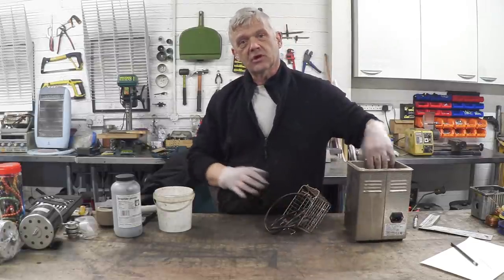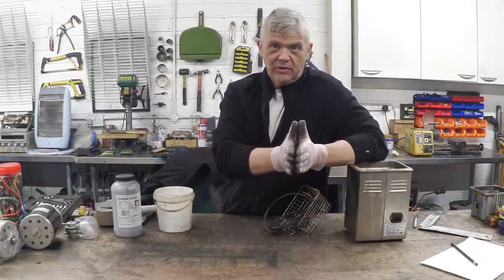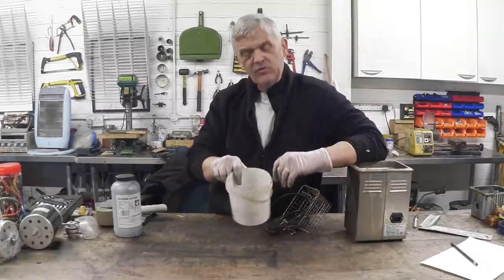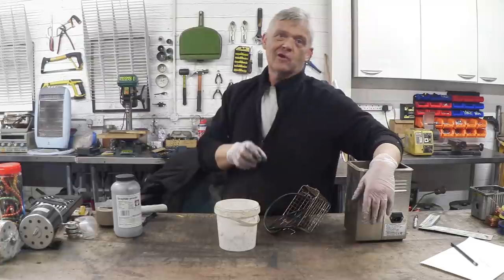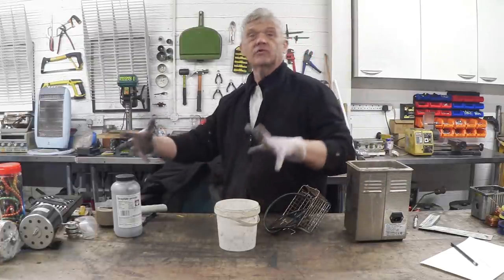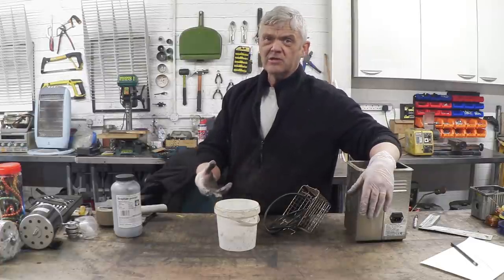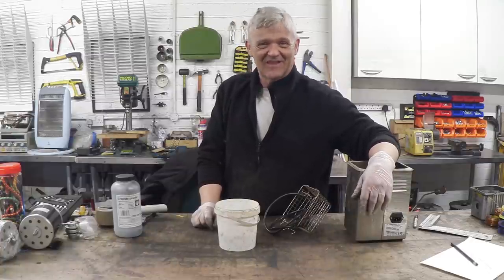You can begin this journey using graphite, but in graphite the layers are fairly closely attached. It's much easier if you use exfoliated graphite — I showed how to make this in video 1083. Because the layers are spread apart so much more, all of these methods are much easier to achieve with exfoliated graphite. That was a whistle-stop tour on mechanical methods of creating graphene — they're all pretty much based on impact and shear. We will be covering electrochemical methods next.